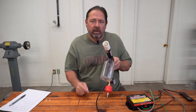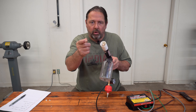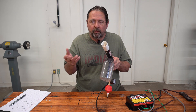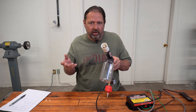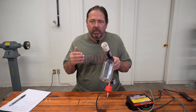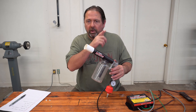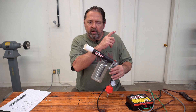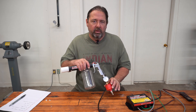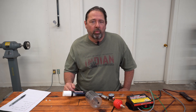This diffuser has a half inch deep hole in it to fit over the electrode — it does not go all the way through. As far as the material goes, I'm using brass because I had half inch diameter brass rod on hand. You can use aluminum, steel, or any conductive material. You can refer back to my last video of me using this gun — I'll put a link in the corner — and you can see how the powder comes out. That's at 8 psi. Turning the psi down to five to seven pounds would work a lot better.